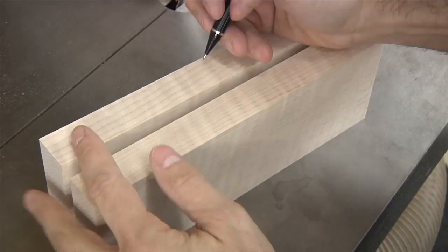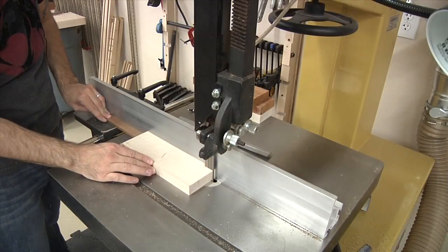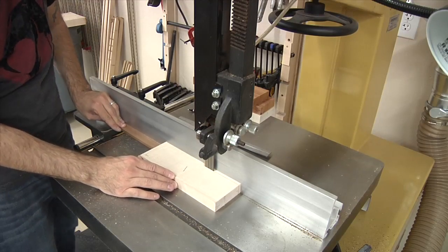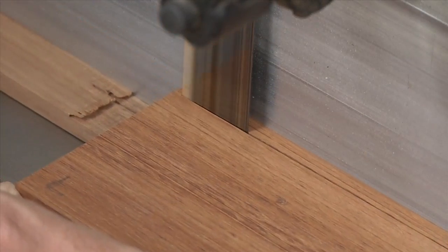Now we need to cut a 1/4 inch strip from each side. I want to keep the grain aligned, so I'll place some numbers and marks on the blank ahead of time. Keep in mind that if you use the table saw to cut these strips, you may want to keep your blanks a little bit wider to accommodate the thicker blade. I'll cut 1 strip from each side of every blank.